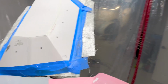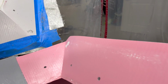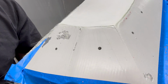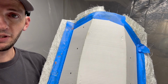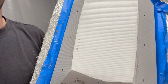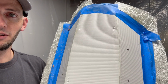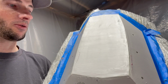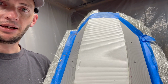It also pulled on this side, you can see at the top, all that white, that all transferred. Same there, that transferred from there. At the end of the day, it's not that bad. This is the surface that I needed. You can see some alligatoring, but once again, this is not a mold surface, so this just needed to fill a hole basically. I don't really care what it looks like, hence why I'm also okay with all those ribs. So this is gonna serve the purpose.